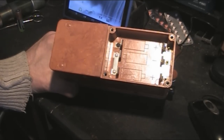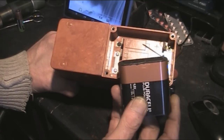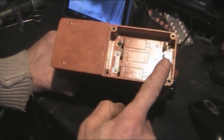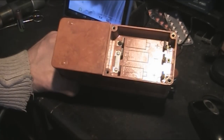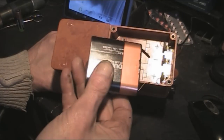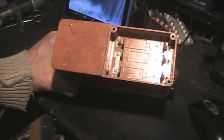There is a battery available that will do it, and that's the 3LR12. You can't just put it in there, because what you actually have in here is a plus link through to a minus, giving you a three volt supply to power the Geiger counter, and then there's one that powers the dial light. So three volts there, four and a half volts there - you can't just put that in there as it'll only power the Geiger counter side and may actually overpower it, potentially damaging it.